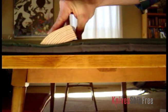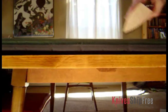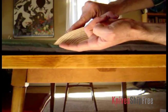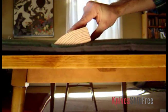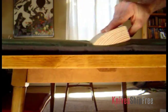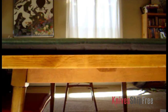So as you sharpen an edge like this on a soft surface, you can see that the abrasive, whatever we're using, curves around and just comes out right at the edge of the blade. So that's why we use something soft, either leather or typically a mouse pad, underneath the abrasive when we're sharpening a convex edge.